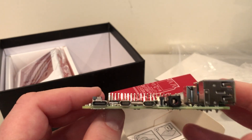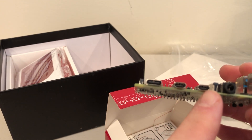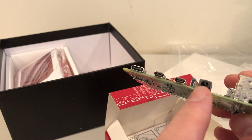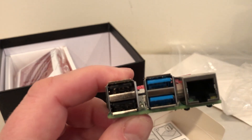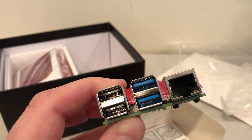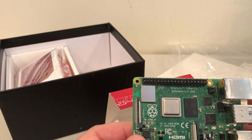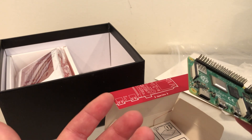Looking at the Raspberry Pi itself, we have USB Type-C for power, two micro HDMI ports for video, an audio-visual out — I believe you can hook up a dongle like old camcorders use to output RCA video, and it does standard audio as well. Then we have four USB Type-A ports: two USB 2.0 and two USB 3.0. We also have gigabit ethernet, and then we have GPIO pins that people use for different projects — connecting things. That's more for tinkerers, not people using this as a desktop or media device.